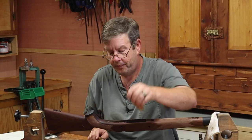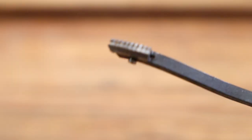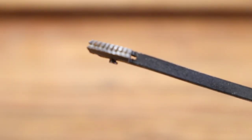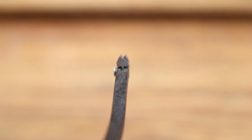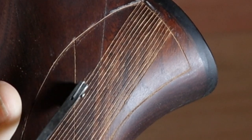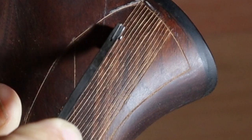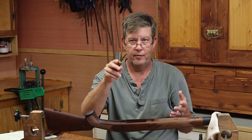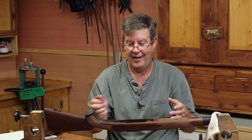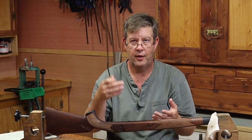After that, we're going to a spacing cutter. What the spacing cutter does is it has an edge that's going to ride in an existing line, and then the cutter offset from that edge. So this is going to give us a line that's parallel to the existing line. And essentially all we're doing is taking this spacing cutter and going from line to line to line to line until all of the lines are cut in one direction, and then we're going the opposite way.